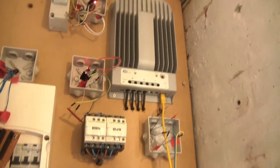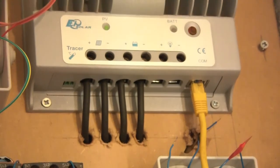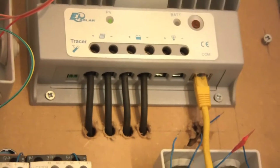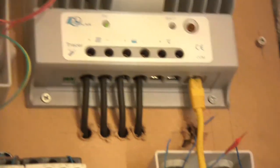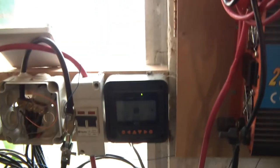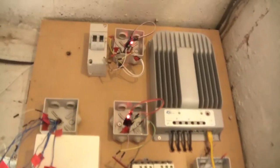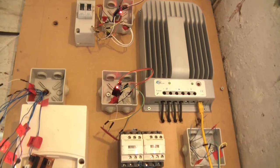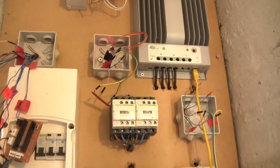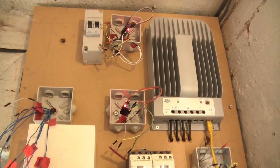What I found out about this unit is that it uses RS485 and a protocol called Modbus. If I program the Arduino to communicate using the Modbus protocol, I can get any of that data — and possibly more hidden data. So that's where the project is heading now, and I'll let you know when it's done. Thanks for watching, bye.